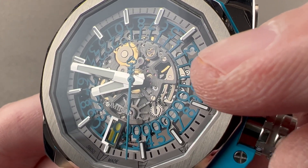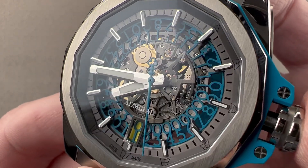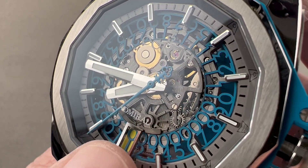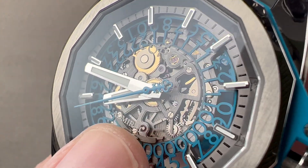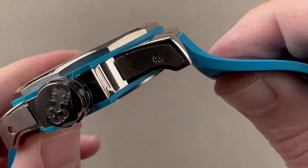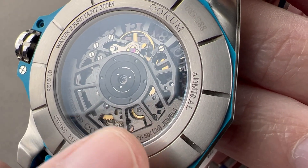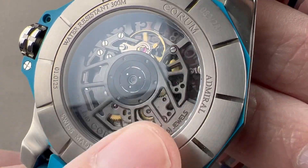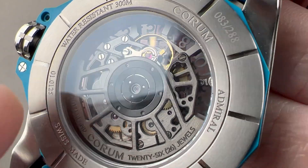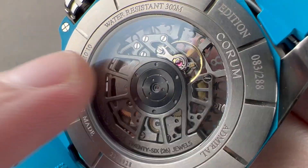You can also see the clutch, clutch lever, clutch spring, and winding pinion. If you look carefully, you can also see the crown wheel of the keyless works — all of that has been nicely finished. You can see the barrel's been opened up; the coiled mainspring is a sort of unofficial eyeballing power reserve, so you can estimate from the coils of the spring how much power reserve remains. Everything's been satinated, polished, or grained. It is quite attractive, though not artisanally finished — it is beautifully detailed and a lot of work went into this. It's a Sellita SW300 base because it's 26 jewels, whereas an ETA 2892 would be 21. Bi-directional winding, automatic, 42-hour power reserve, 4 Hz beat rate, quick set with hacking seconds, and fully skeletonized with a super attractive satination across all the bridges, and black polishing of the regulator and assembly screws.